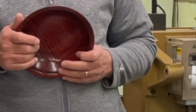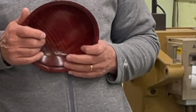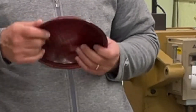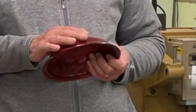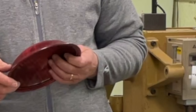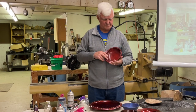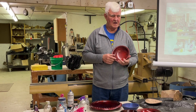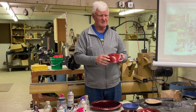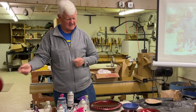Are you sanding with sandpaper or steel wool? You're going to be there a long time with steel wool. When you put black on here, you've got to get rid of quite a bit to get into the raw wood. This was probably power sanding most of it, and then hand sanding — you're sanding it mostly back to bare wood. Anywhere you see that light color, yeah, that's bare wood. There's quite a bit of sanding back in this one, but it's a great way to do that.